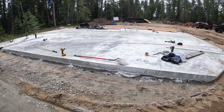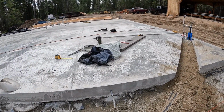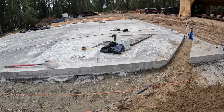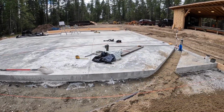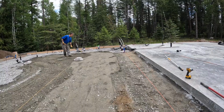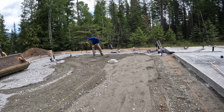All right, we're plugging along here, starting to get all the pipes bedded in, drilling holes now to tie the rebar into the other slab. So we went in 3 inches, and then we'll epoxy those in, and we did those every 4 feet, and then we'll be able to also tie in to the protrusions also. So coming along, bringing it up to 8 inches below slab grade, 2 inches of foam, 6 inches of concrete. So plugging along. I feel like Eric's working harder than me, so I got to get back to work.